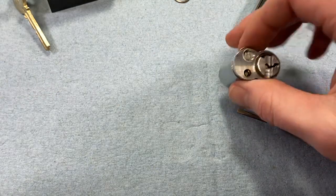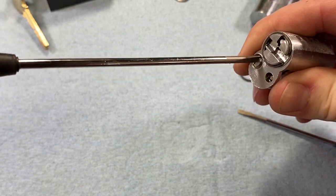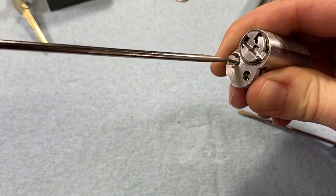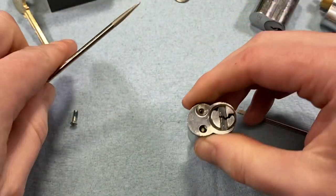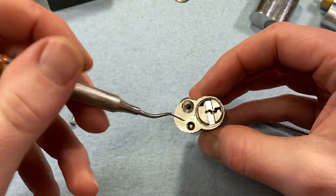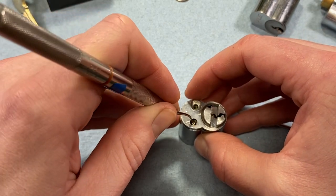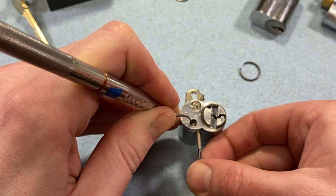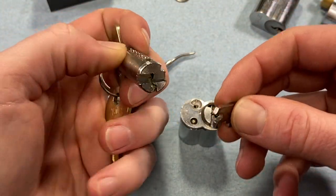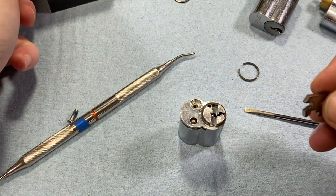You should really never have to remove this lug, because if that goes south something else will have already failed at the same time. These are made of — I'd guess some sort of stainless steel. To remove the lug, once you remove that screw there's a detent which is spring loaded, so you have to remove some of that pressure and then follow it up with a screwdriver to pull it out. When that pin is lifted up by the control key, that's what we're engaging with to pull the lug in and out — pretty simple.